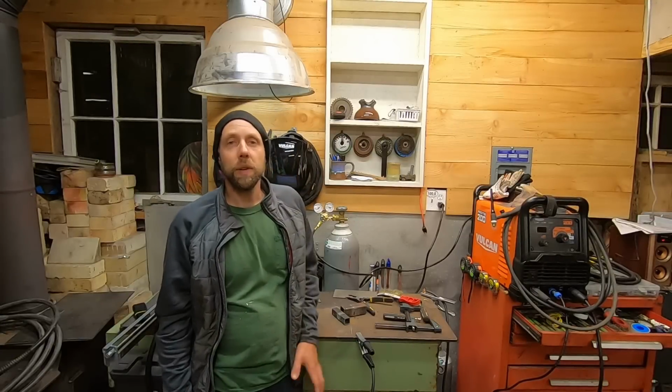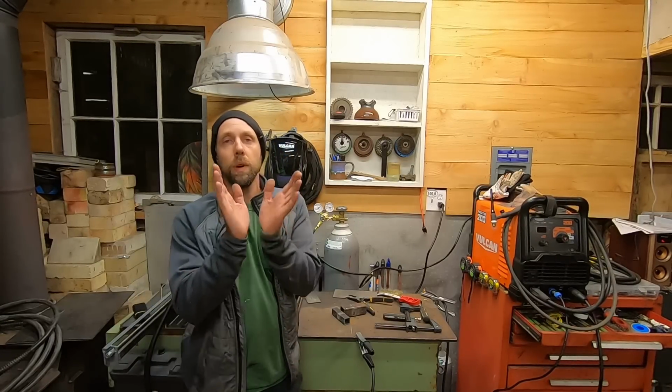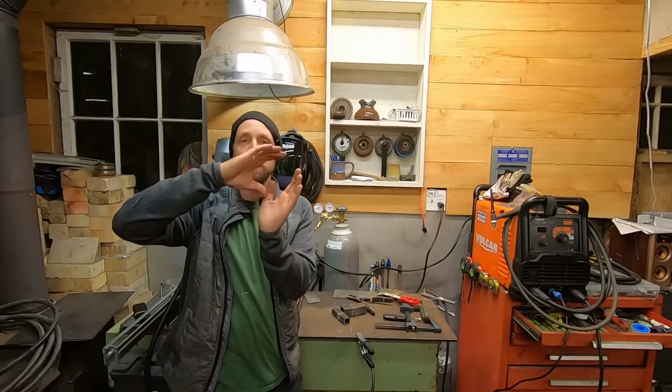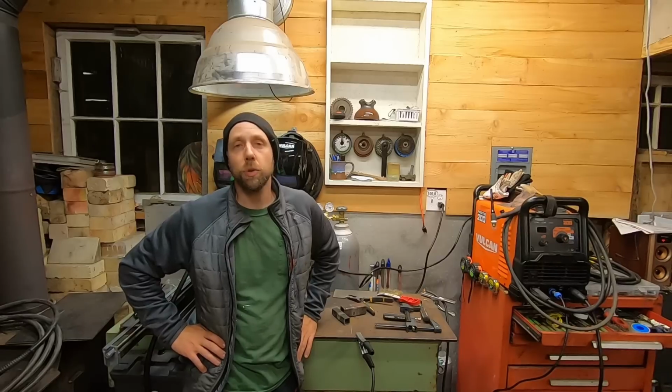So if you guys are welding a thicker metal, like say 1/4 inch, stuff like that, you want to chamfer your welds, just cut them as kind of a V shape where your two pieces butt together so you can get that bead deep down into there and fill that whole area. You'll have definitely a deeper weld and just a stronger joint right there.